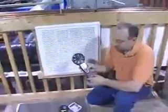When we use a vane anemometer, the first thing we need to do is set it up. We're going to press the button to turn the equipment on, and we want to make sure that we're set for feet per minute and degrees Fahrenheit. The user's manual tells you how to set up those parameters, so we're not going to spend a lot of time on the actual setup to get it to standard English units.